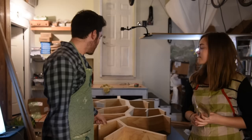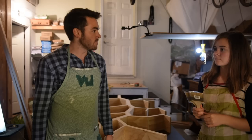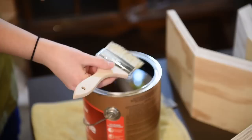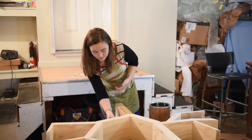We're back to brush on some polyurethane. The tree is all sanded and we wiped it down with wet rags to make it dust-free. Make sure you're in a ventilated area — this stuff smells terrible. Full disclosure, do this outside please. We're applying it on the wood, and also on the paint to protect it as well. Polyurethane makes for a nice, clean, protective coat but will raise rough burrs when it's finished drying, so make sure to go over it with a light piece of sandpaper.